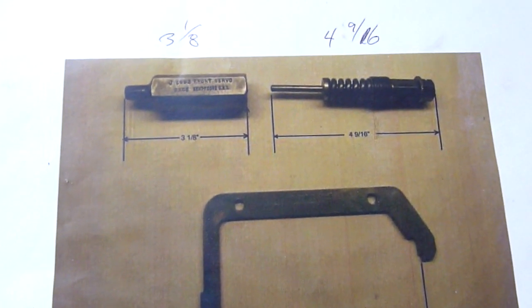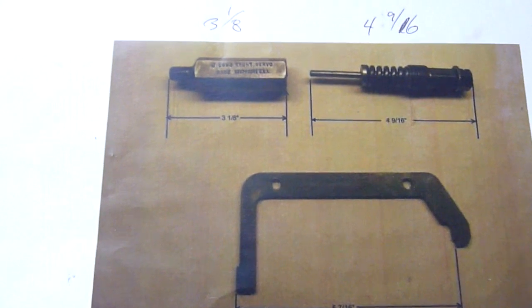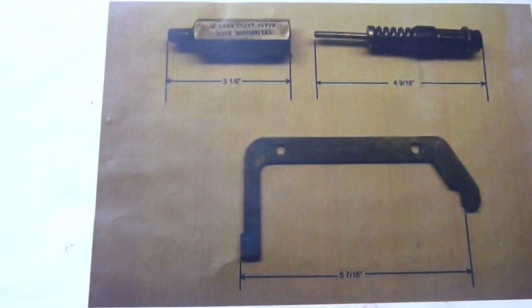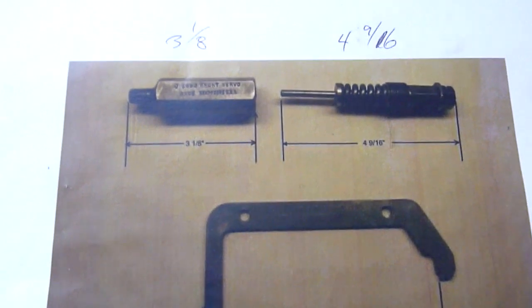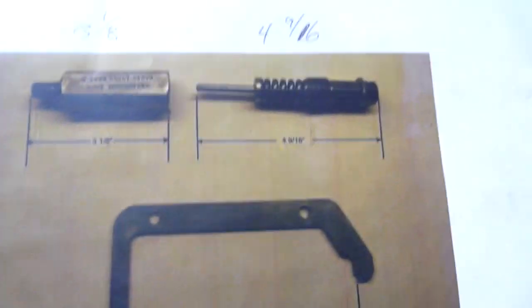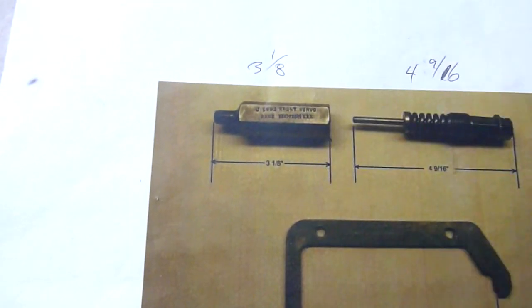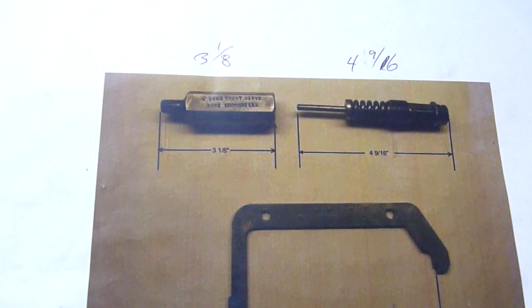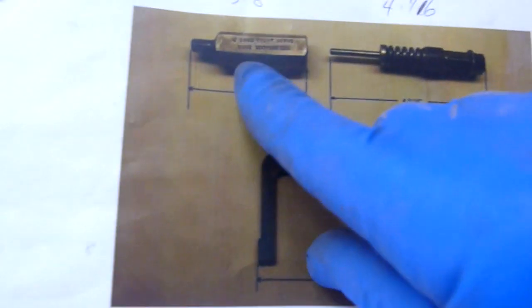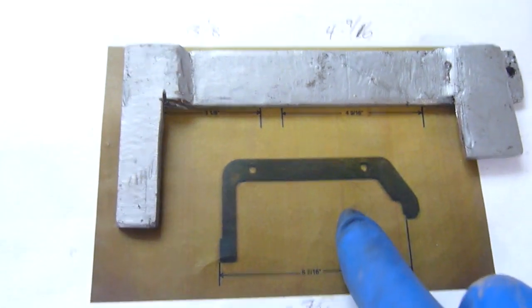I'm getting about a 0.1 inch difference, so I'm thinking probably the spring is too light. I'm going to try and make a bigger one. The fittings I used are just pieces I've had around the shop, including a long bolt that was only threaded partway — I used that as the actuating pin — and then a wing nut on the end, and a bolt that I drilled a hole through and tapped to fit. I need a stronger spring, and there's a limit to how strong a spring I can put into that housing, so I need a bigger housing.